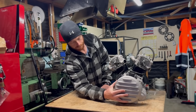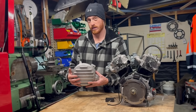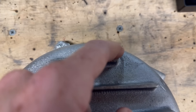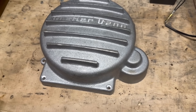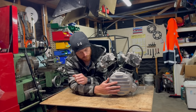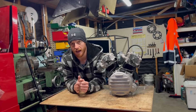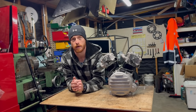This is the flywheel cover. It slots neatly onto the engine, but this part is a throwaway — there are a couple of minor defects. There's pitting around here because I hadn't quite sanded the pattern down enough on one of the edges and it kicked a little bit of sand into the mould. The foundry wanted to do better so this was a bin job, but I've managed to get my hands on it for test purposes. In this video we're going to make a fixture for holding the flywheel cover, as it is a fairly complex shape with no real flats and no good way to hold it. After that we're going to finish assembling the top end of the engine and then fire it up for the first time.